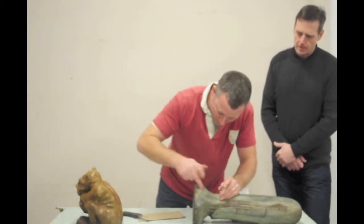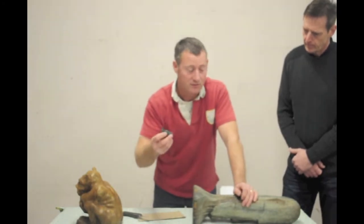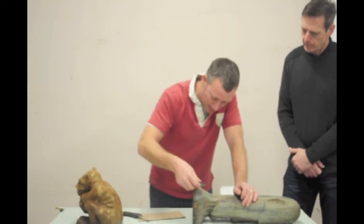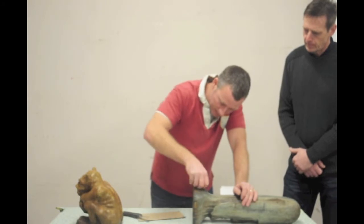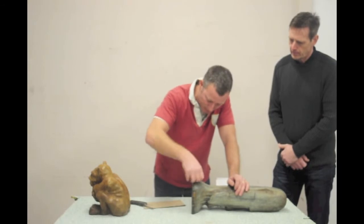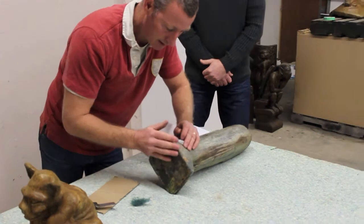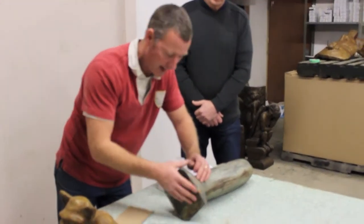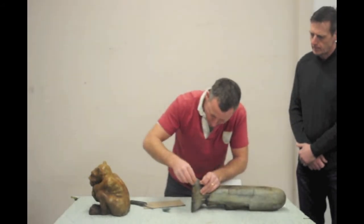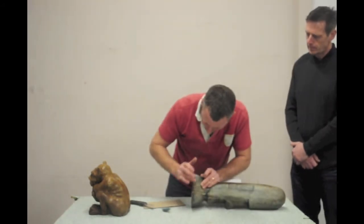This particular piece has a bit of a rough texture, a rough finish. So what I've got here is this green scrubby. It's up to your imagination what you can use to sort of match the texture. If I just press this onto the putty while it's still soft, it's going to put that texture in there, and when the paint goes on it's just going to help make it look exactly like the original. You can see that we've already lost that void and the cracks — they're all covered up. It's actually looking pretty good. There's one more tiny little bit over here if you want to get a little bit fussy, but some people like to.